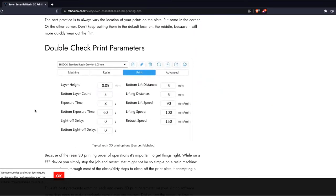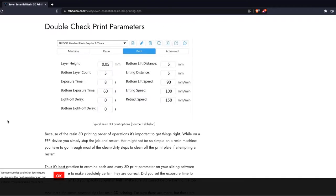Her exterior walls are absolutely terribly insulated. The home was built in the late sixties, and whatever was in there has disintegrated — there's basically nothing left. The only way to do it is from the inside. Can't do it from the outside easily because it's a brick facade on the whole house, and I'm afraid of them popping a brick and cracking the mortar. They're going to go from the inside, and I'll deal with having holes patched and repainting.